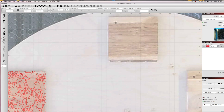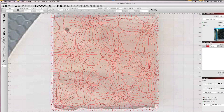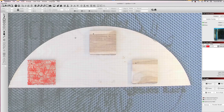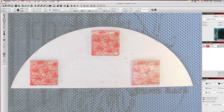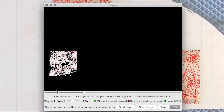I was looking for a very specific look on these little coasters and wanted to make sure the design extended all the way over the edges. Notice how I also spread the coasters out into random places on the bed of the Thunder Laser, just to show how handy the camera really comes in. I just duplicated the design by going to Edit, then Duplicate, moved that overlay onto the next coaster, and then did it again for the last coaster. You can also see I placed a thin piece of wood under the coasters themselves just to avoid any flashback since it was engraving beyond the actual coaster. I put the settings in for the engrave, did a preview to make sure it looked accurate, and then hit send.